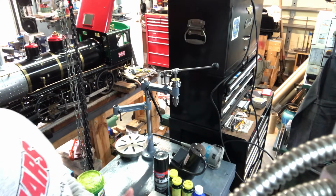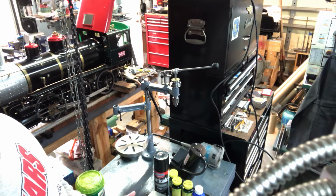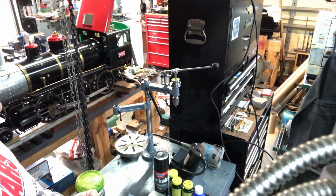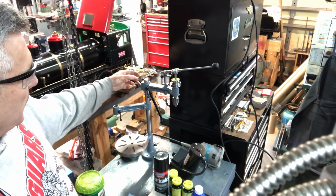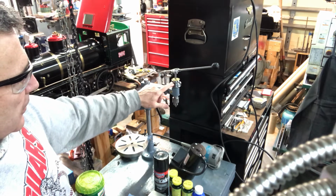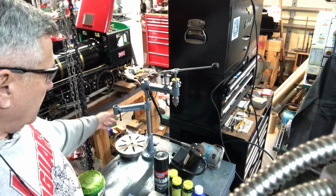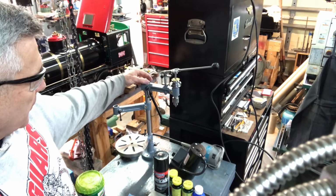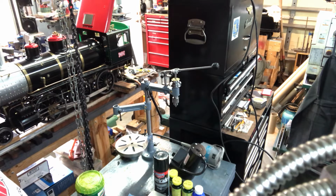So the next step that I'm not worrying about, but planning ahead, I'm kind of really torn here, and I'd love to hear more feedback and input from everybody. Just this morning, I looked at it last night, and this morning I thought, I'll probably go ahead and make the little jockey block and jockey pulleys on the back, because it was actually kind of fun making the drive pulley for the spindle here. And then you can mount a motor down on a table and have a tubular drive belt come up over the jockey pulleys and drive the spindle.